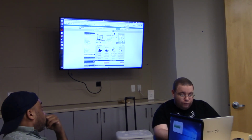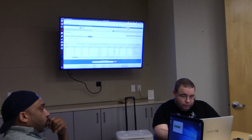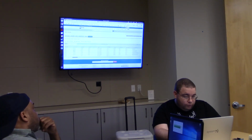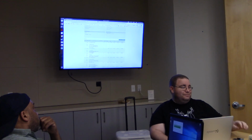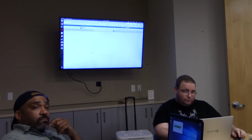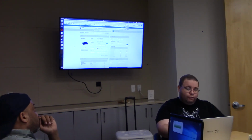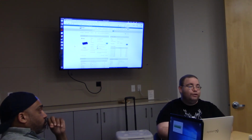For this, you've got 40 for the whole shebang. This RAM, 40. Well, I haven't found any RAM chips that get that fast yet. This one does. They're usually specialized just for video. Yeah, 1 megabit. It's why you have GDDR spec RAM on graphics cards rather than DDR. This is 1 megabit, 10 nanosecond, 128K by 8, fast async SRAM.